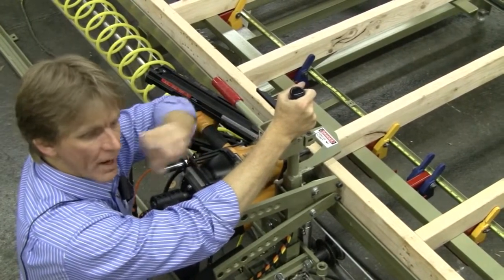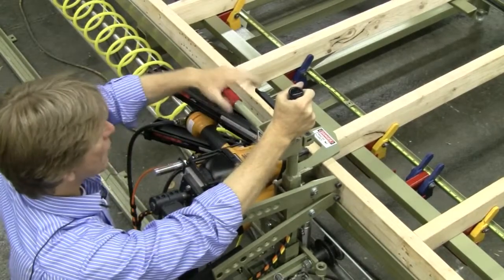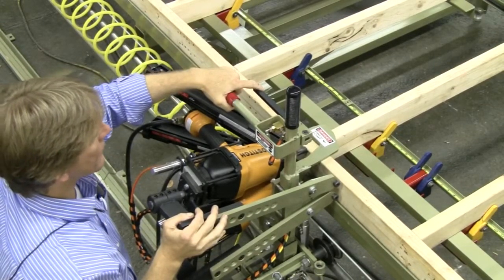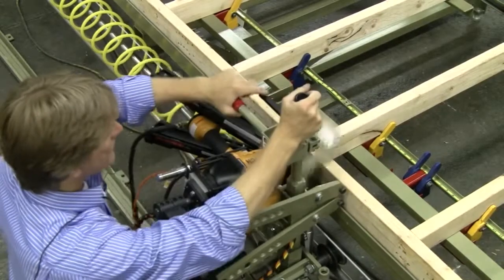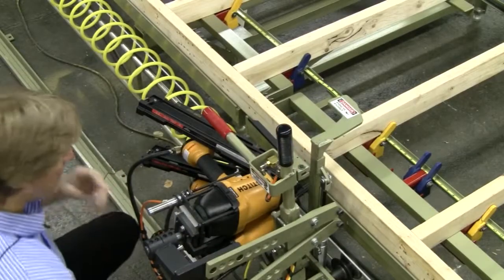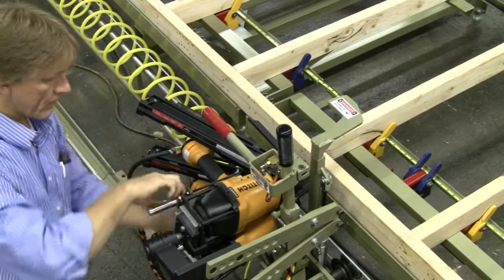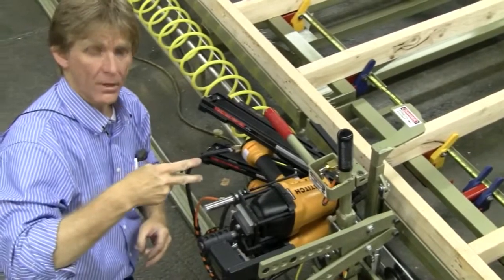Why do we want to do that? You want that connection as tight as possible so when you're putting sheetrock or OSB on here you're not having waves go by. There's a black trigger you're going to index with your finger and go ahead and fire it right off. Every time we fire that, we activate a trigger and we're actually pulling each one of these triggers on each gun at the same time, firing two 16-penny nails at one time.